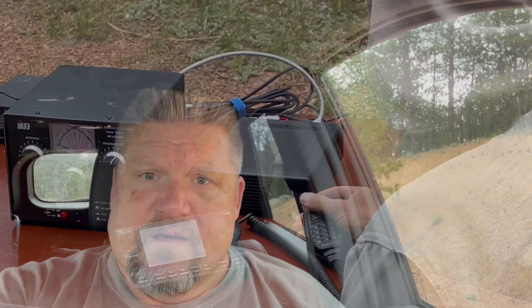VE-02X. End of the video. We got the Skyloop installed. We tried it on 20, 17, and 40 meters, and then the rain moved in. We tuned it in — one-to-one SWR on all three bands — and it seemed to work just fine. We got into Canada, Virginia, and somewhere south. We were able to get into Michigan as well. When he switched over to 40 meters we had just started on that one when the rain started to move in, so we had to tear everything down. There was lightning in the area and rain, so that's pretty much the end of a Skyloop install.